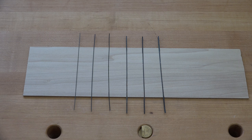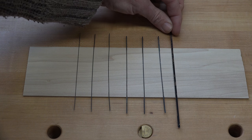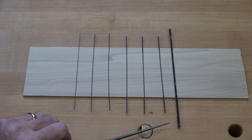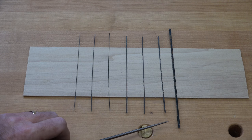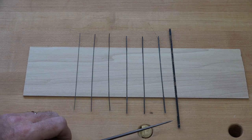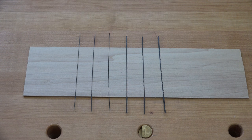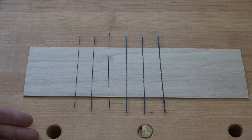Just to illustrate the pinned blade point — look at the size of this pin blade. This isn't a typical five-inch pin, but it shows the girth required to get pins into the blade. You are absolutely not doing any tight cornering with a pin blade like that. If you want to do fine fretwork, try to avoid pinned blades if at all possible.